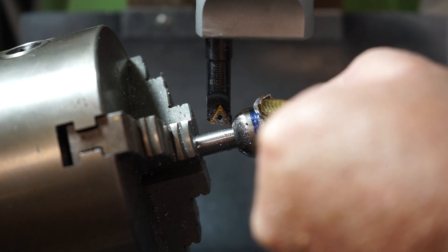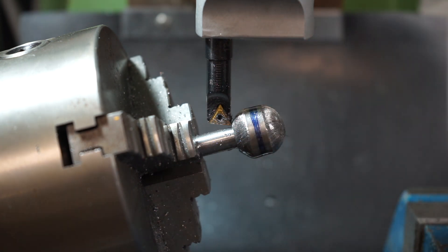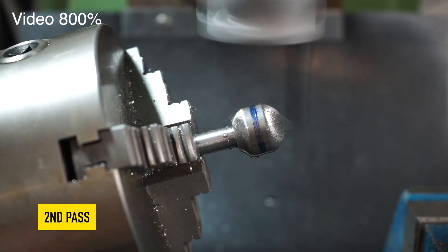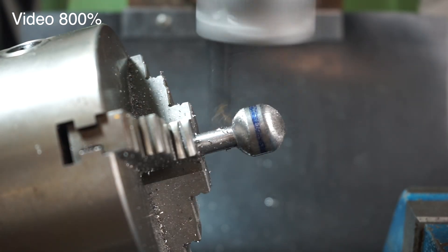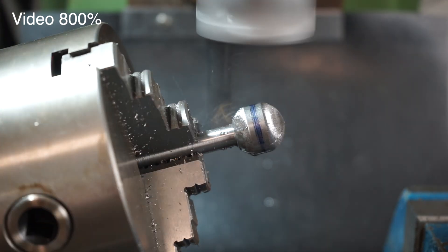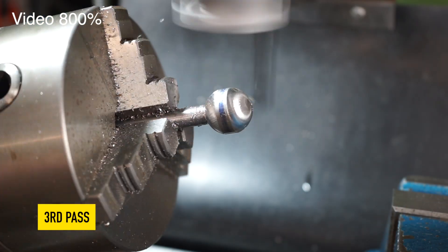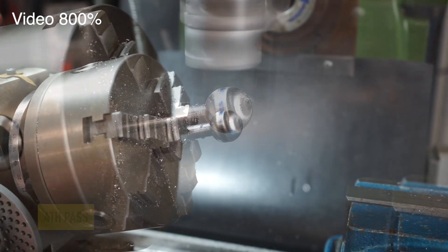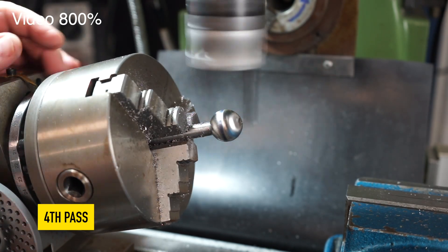I'm going to oil that up — get a little bit of oil on it. That steel is not easy to cut in this operation. I've sped the footage up to save you the pain of watching it. You can see it's cutting much better now that I've tightened the boring bar head up and stopped the tool from twisting. What I'm actually doing is lifting up a little and dropping down in Z each time about half a millimetre to get closer and closer to that size. With every pass the ball is starting to appear and look a lot better.